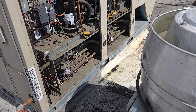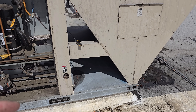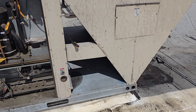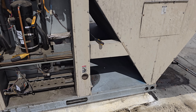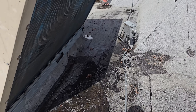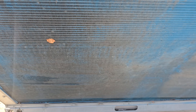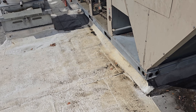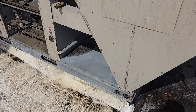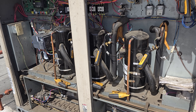This unit is doing everything it can — working as best as possible. The condenser's as clean as it can be without going too crazy. There's always going to be a little bit of grease on there because it's a micro-channel and you can't really strip that grease off completely. It's not bad — it's clean, it's moving air really good. I also cleaned the metal mesh, put the unit all back together, rinsed down as much dirt as I could. I'm not seeing anything else wrong with the unit at this time.